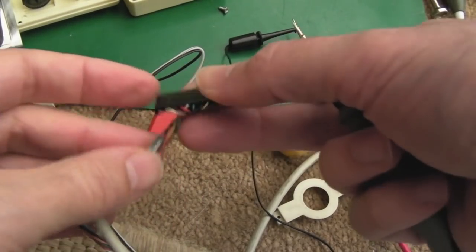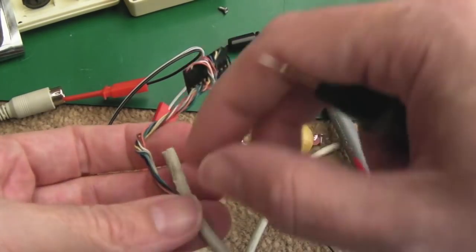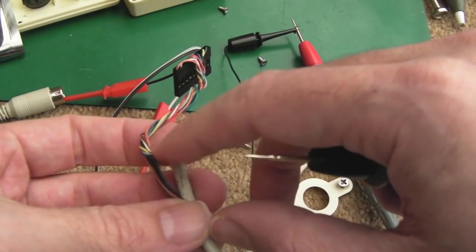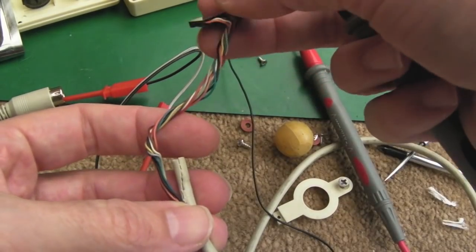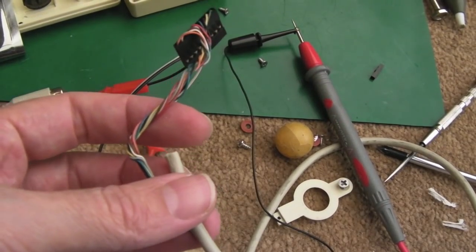Just watch this - it's just here somewhere. Yeah, and I'm holding this in here firmly at all times. It is definitely related to the cable. So, it's just the green. So now I know that, I'll try and separate the green a little bit from here, maybe cut into it and inspect it all the way along. I've cut the sheathing off - we can put a little piece of heat shrink tubing just around the green wire once we've worked out where the break is.